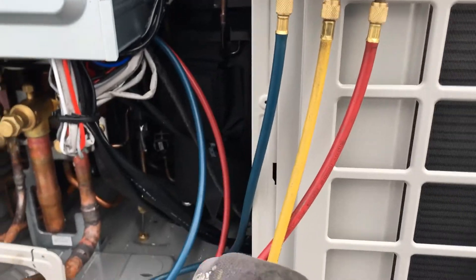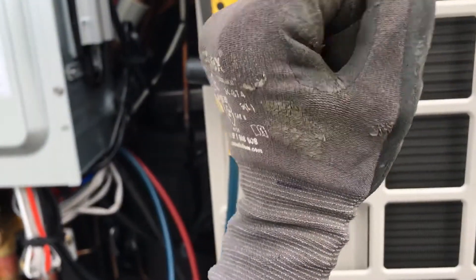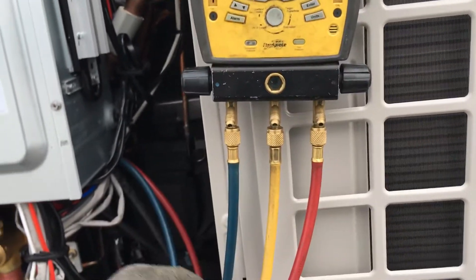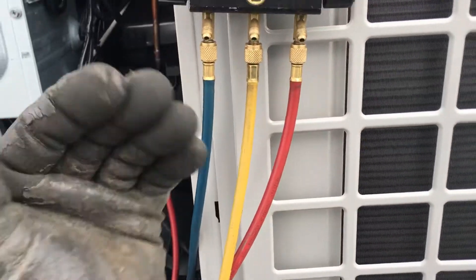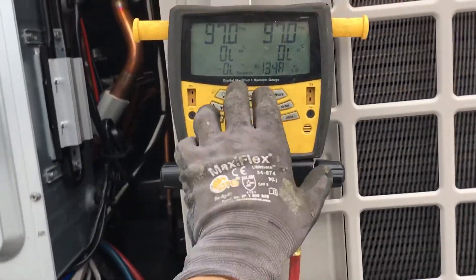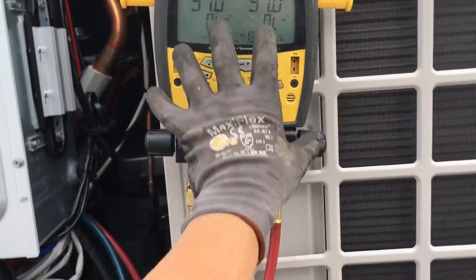Today I'm working by myself — my son is attending a funeral. I didn't waste all that nitrogen filling up a whole bunch of air handlers. I ran downstairs, heard the hissing, located the leak, and fixed it. I came back up and I'm now testing my first stage after doing the repair — it's holding rock steady at 97 psi.